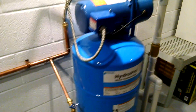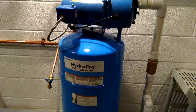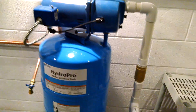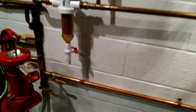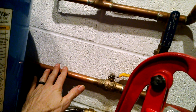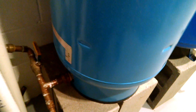This tank here is integrated with the pump, so you don't have as much control for separating, isolating, or swapping the tank. But it's a 2013 model, so I don't expect problems with it. I put a drain over here — that's the best I could do — and it has an isolation valve so I can isolate this from the system. If I have a backup pump hooked up here, I can isolate this whole section and work on the other side, where I also have a tank hookup where another pump can be connected.